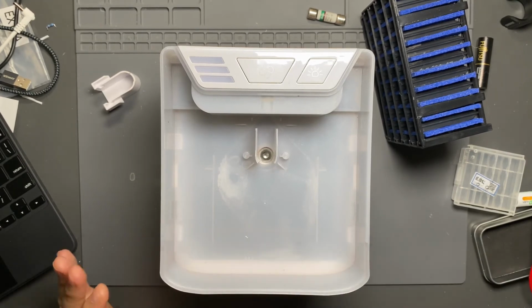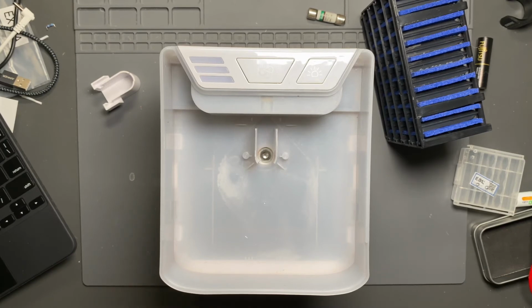But hard water or water that is not clean can release those minerals and vaporize them into the air. If you're in a well-ventilated space, and if you have other means to provide cooling, like your air conditioning, the example I gave with running it to augment the air conditioning, then the furnace filter or just the act of it running through the evaporative coils in the system generally traps that and removes those from the air. Or they'll just settle out of the air onto the surfaces of your house, floor, carpet, whatever. There are ways to reduce that if you're particularly sensitive to it. I'll get into that. It's going to be another video.